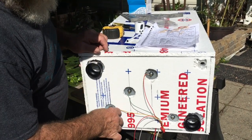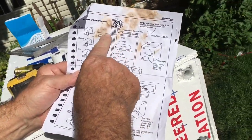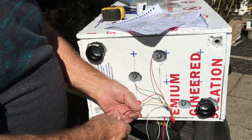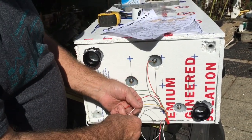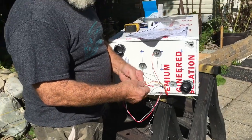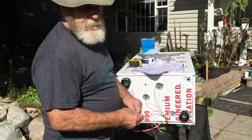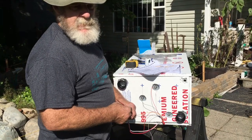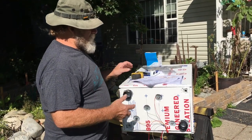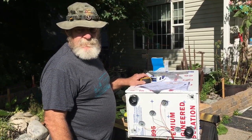And then there's a control board inside, which all these go to. This is our control board for inside. And so this red and then this common actually comes from the control board. So this would be our hot and this would be our negative. And then these two wires down here are the heating pad we stuck underneath it. And it is on a thermostat, and we're gonna have a switch upstairs. So that way if we got to a real cold spell or something, we could put a little bit of heat on this to keep it from freezing. And we did insulate this. I'm getting ready to make the metal box that we'll slide it into and then mount it up. So when we get a little more ready on this one, we'll do a little more videoing.